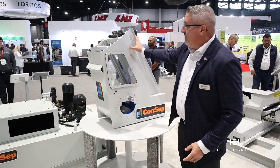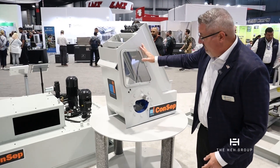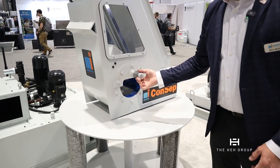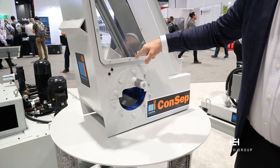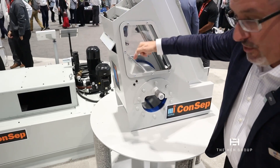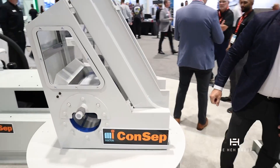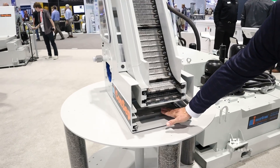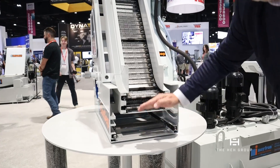So you've got your top conveyor, just like over there, and you've got your bottom conveyor, the separator conveyor. You can see this filter drum in here that rotates with the belt. Inside here is a spray bar — that spray bar is spraying coolant to clean the filter panel. As that's spraying, those fine particulates drop down, and on the back side you can see: here's the top conveyor, here's the drag conveyor. Those fine particulates go on the bottom, and we scrape them up and out.